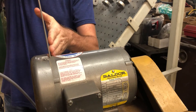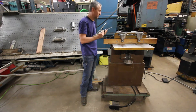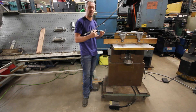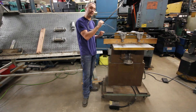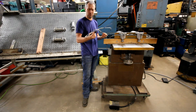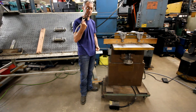If a bearing is about to go, you'll actually be able to hear that in your ears. This is hard to explain — you'll know immediately the first time you try it. I've done this with tons of my customers, handed them my stethoscope, and immediately they say, 'Oh, that's what you're talking about.' Even untrained, you're going to be able to hear when a bearing is about to go out and when it's okay. It's an amazing, super simple device — literally just plastic and metal. Any quality will work; guys used to use screwdrivers held up to their ears and wooden dowels. This is just the advanced version of that.